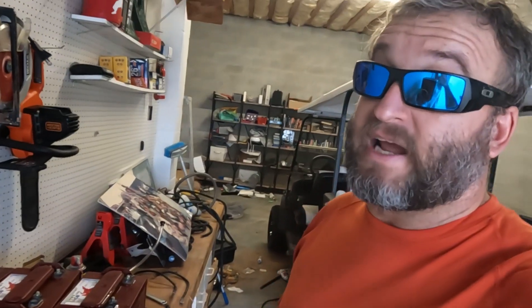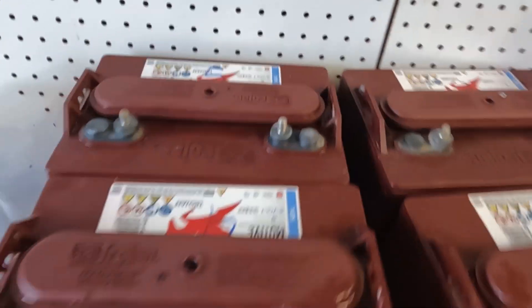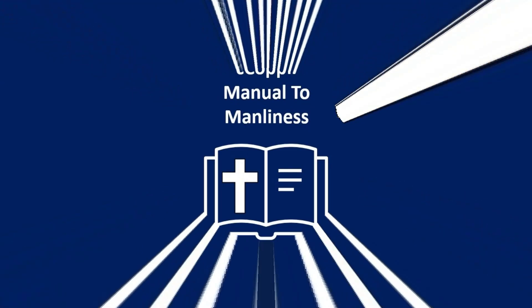Six clean, eight-volt batteries — all tested at eight volts, all with no sign of penetration into the cells. They're all very, very clean now, almost like new. That's all for today's video: cleaning and checking batteries, how to do that for lead acid batteries, and singing the praise of the Trojan HydroLink system for waterproofing the batteries — even from salt water. Our next project is to replace the battery tray — see how nasty and rusty it got. Now that the batteries are out, we can easily test the motor as well and see if it survived the water. It's a very easy test, we'll do that in another video. Hopefully you don't need to replace it — it's a really nice 30 mile per hour motor. To be continued, thank you.